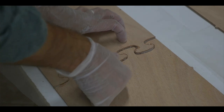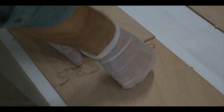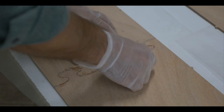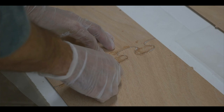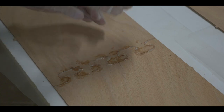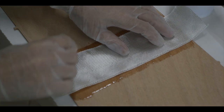We're going to carefully fit the individual pieces of the panels together. Some of the pieces might be a bit tight and that's okay — if you need to, you can put a piece of wood over them and carefully tap them in with a hammer or mallet. Once you have them all in place, make sure the mating sections are flush with each other. You can sight along the edges of the panels to make sure the curves are nice and smooth.